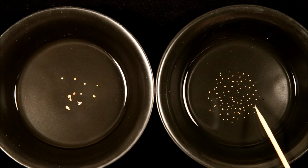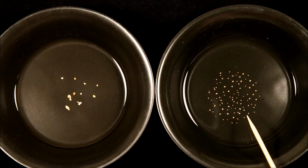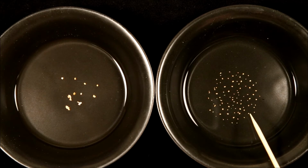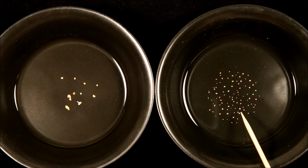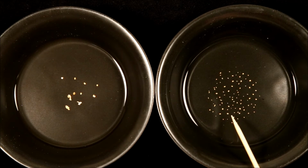Well over 100 pieces. And this material is really nice to process. It is super clean. You don't have to wash this at all. It won't make your panning water or your Miller table water cloudy. There is no black sand at all to bother with, which is nice. The extremely uniform size, almost entirely in the plus 50, means you don't have to worry about classification. You can just take this stuff, dump it in a pan, and off you go. So my complaints about it being wet and the hassles of drying it for classification are only if you want to do a dry classification, which, because it's so uniform, isn't really necessary.